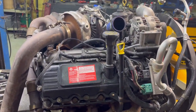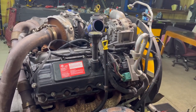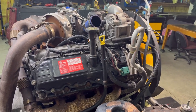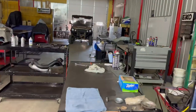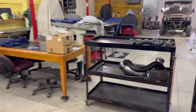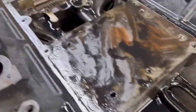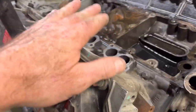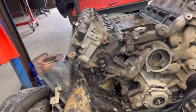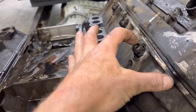How many parts are there here? I'm just kidding - we're going to take it apart. Joey's going to do the 6.4 over in the other bay, just take it apart - he's going to learn by fire. Turn the lights on and get to work. We do go ahead and put a coating under the body too. Get our used parts box, start with paint - got all that done. We're going to clean the injector hold-downs, injector pigtails, the ends, the harnesses. Throw a little brake cleaner on there, a light blow gun, then a little WD-40, then another blow gun - if you do that they'll look brand new.